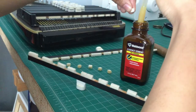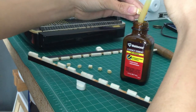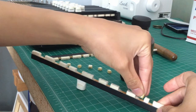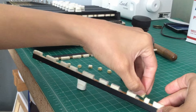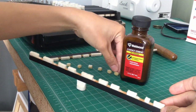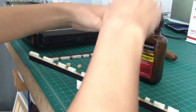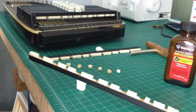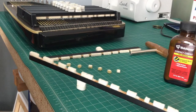Here is the method I like to use. Instead of using the brush to brush the contact cement on, I'm just dabbing the felt block onto it and then using the excess to coat the surface of where it's going to go. It's very important that you don't just stick it on right away — that's not how contact cement works. I have a video on how contact cement works, please look at the video if you don't know. Basically you have to let these cubes dry for about 10 minutes. Do not skip this step.